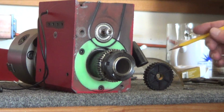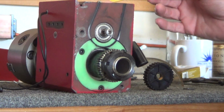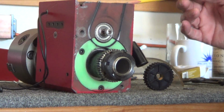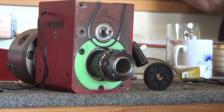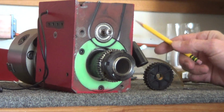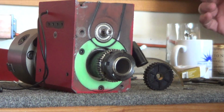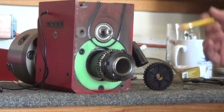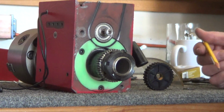And yeah, I think I said in other videos, they overspray paint, and you have paint where 5/1000ths here, you can imagine the angle you're going to get on your work in the run out, way down 6 inches down the line. So if you guys ever take the headstock off, clean up all the paint, all the edges, and same way on the bed.